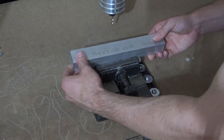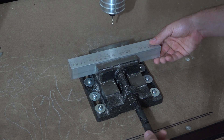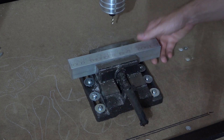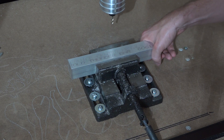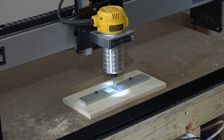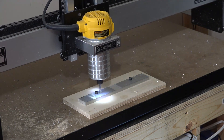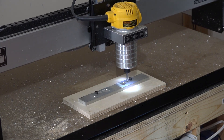What I found is that the best possible work holding method is one that allows me to bolt the part onto the wasteboard. I installed some threaded inserts into the back side of my MDF wasteboard and reinforced them with epoxy. That allowed me to bolt a drill press vise onto the wasteboard, which provides a much better hold. When using the vise, I can't machine the outer edge of the part. When I've needed to do that, I've generally found a way to design my parts such that they include quarter-inch holes that I can use to bolt the part directly to the table. Since I've started doing this, I haven't had any aluminum parts pop loose during machining.